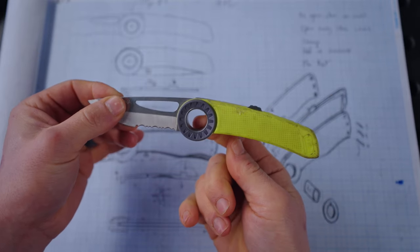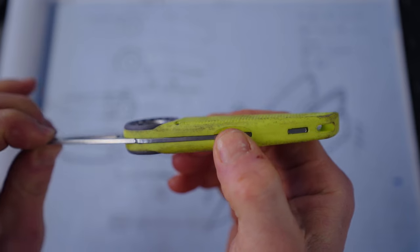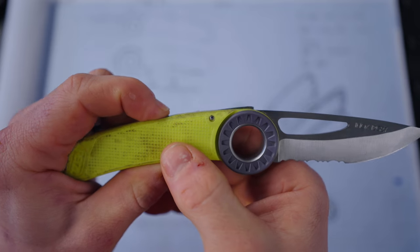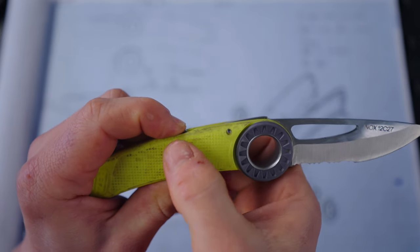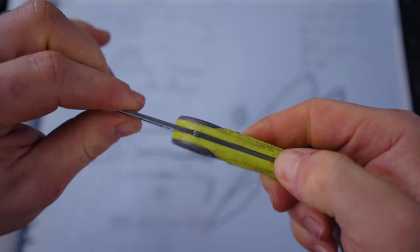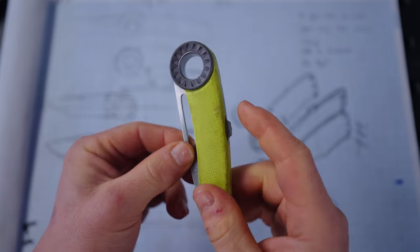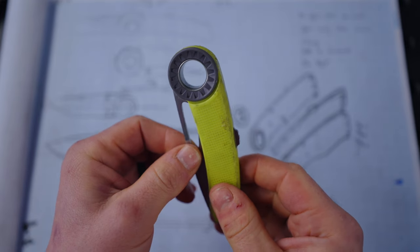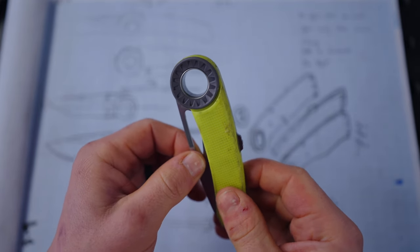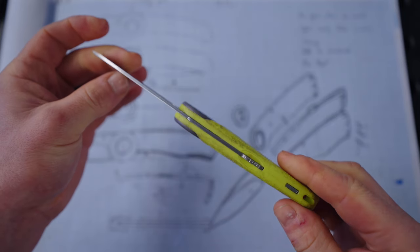one that allows it to have this central carabiner hole. The key is this little sprung spine component. On pressing this button down, the spine flexes back in here, pivots against this pin, and lifts up, pulling it out of the notch that sits within the blade. It can then fold back down, and it also provides a little resistance and a little subtle retention to prevent it opening accidentally before it clips back to its locking position.